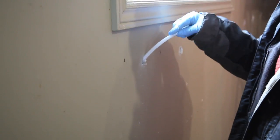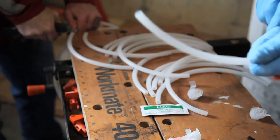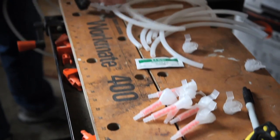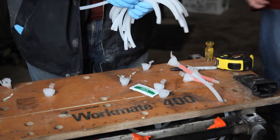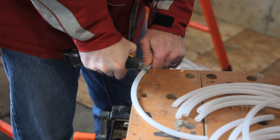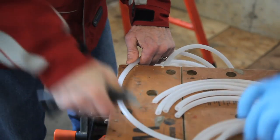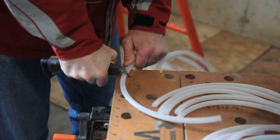Since hollow wall injection involves directing foam downwards into the wall cavity, you'll need to cut short lengths of tubing to fit over multiple spray gun nozzles. These nozzle and tubing assemblies get clogged with hardening foam during normal use, so you'll need to make a bunch to have on hand to swap them out. The tubing used here has a quarter-inch inner diameter cut to 12-inch lengths. Make cuts with a sharp utility knife, not shears or wire cutters, since these crimp the ends of the tubing and impair the flow of liquid foam.